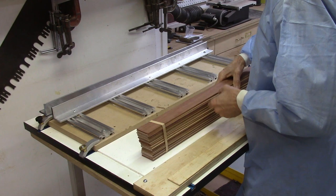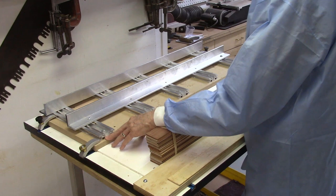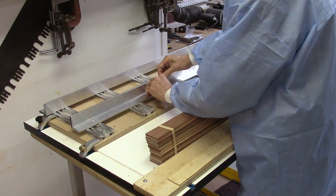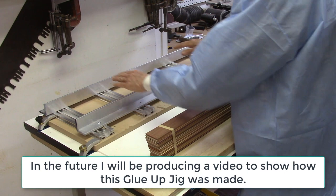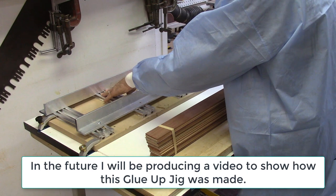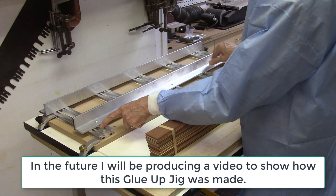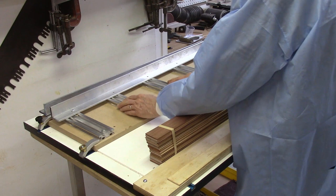So I made a new jig. This jig is made out of channel — five pieces of channel, each one foot long. The back rails are one and three-quarter inch by one and three-quarter inch by quarter inch thick aluminum angle brackets. They ride in the rails so they don't move up and down. The back rail is mounted to the slide with screws and nuts, so it's held fast. The front rail rides on spacers and screws and moves freely back and forth. When I put my boards in and clamp them tight, this does not ride up and down — that problem has gone away.